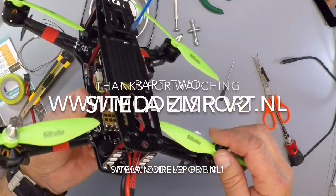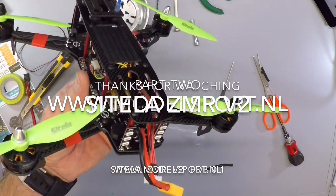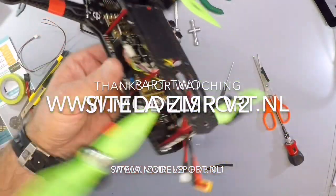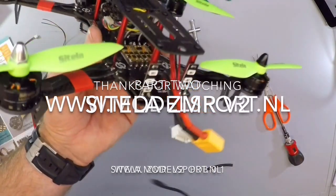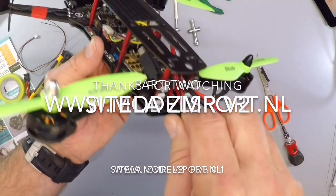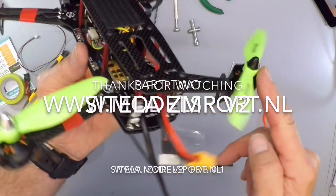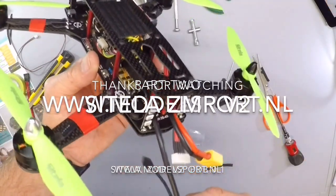As you can see, the Eachine ZMR is pretty much finished right now. I put some propellers and take them off to make the connection to the computer for OpenPilot — you have to take off the propellers for safety reasons. I hope you can see there is a lot going on between the top and the bottom decks, so it's quite busy right there. But you have to keep some space to put your USB connector in the CC3D board like this — you have to make a good connection for your OpenPilot configuration.